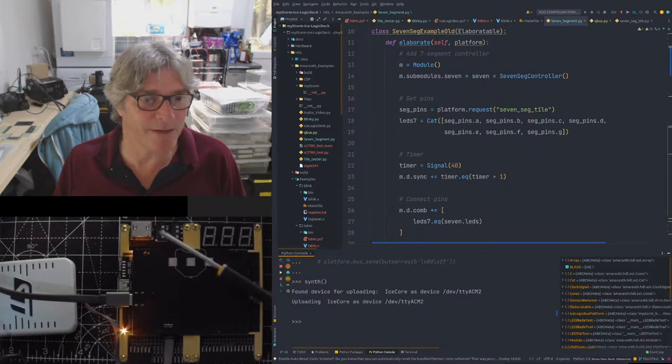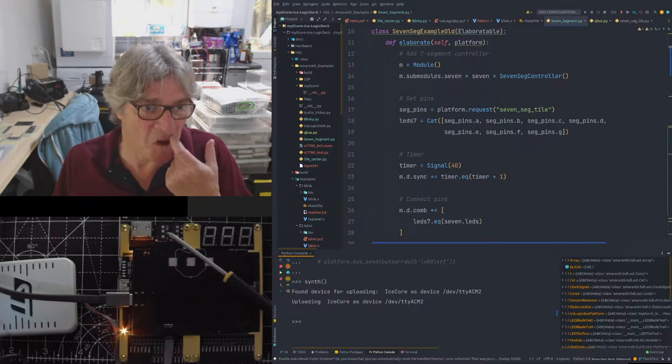And then you normally have either a HDMI or DVI card, or VGA tile. Initially, I'm going to ship these with VGA tiles because this current HDMI tile doesn't work properly. There's a mistake on it. So the initial shipment of the development kit will have a VGA tile, but you'll get the DVI tile in the care kit that comes next month.